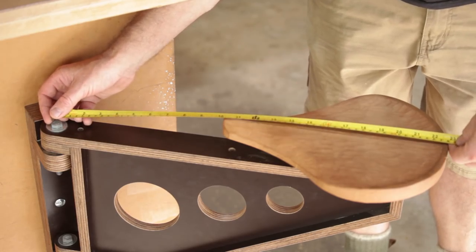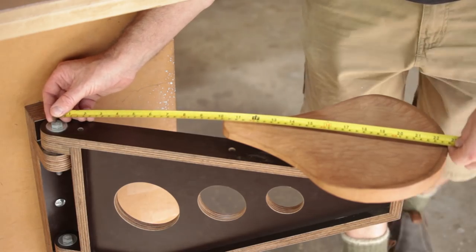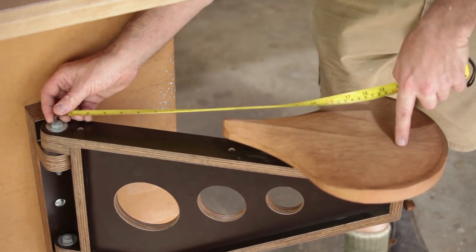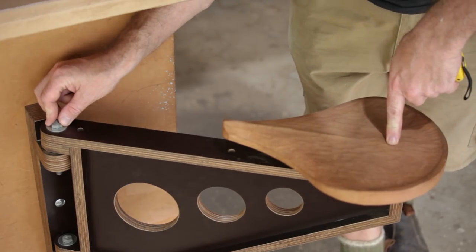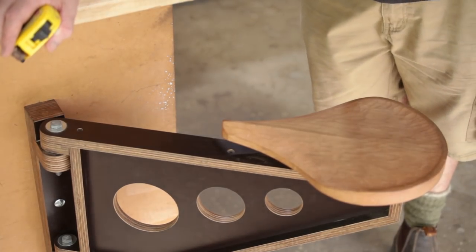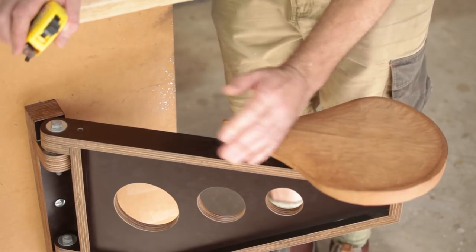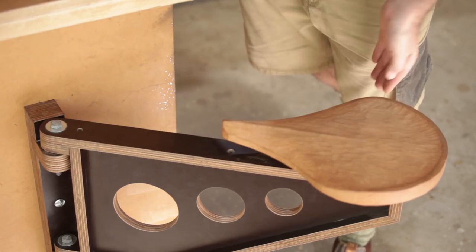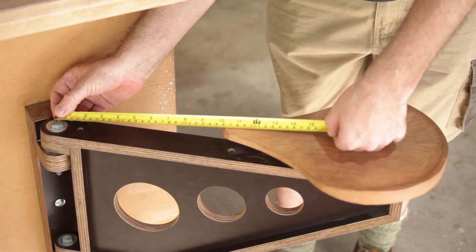The first thing I need to point out is I made this seat far too long. From the hinge to the end of the seat that's 58cm, and my steel one was only 51cm. That 7cm would make a significant amount of difference to the amount of pressure and leverage being put on that hinge. If it was say a metre long the leverage would probably just break it off, so the further we come in the less stress. I only need it to swing out to the corner — probably 40cm would be enough.